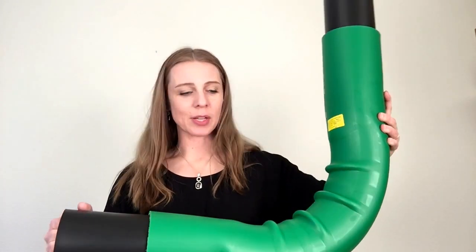Our first recommendation is the double wall elbow for fill lines. This one will go under the fill point and as you can see it's very compact, so it has a low build. Compare that to the regular solution with the formed bend — that one has excellent flow characteristics but it also requires a bit of space, a space that we may not have. So in those cases, go with this one.